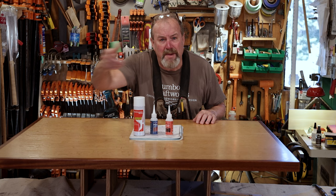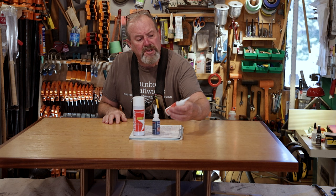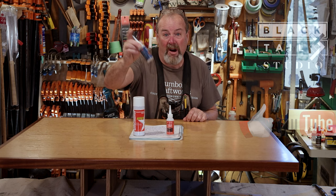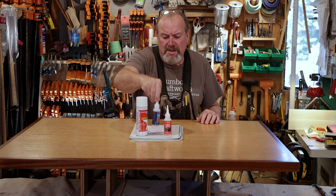We're going to see if the medium or the thick works better for filling in dents and dings on a veneer top, which this is. Sometimes when you put the accelerator on it last, like you're supposed to, it bubbles up and does weird things. So I'm going to try in this video to shoot some of this in there first in the bigger holes and see if it kind of balances it out. So today we're using Starbond cyanoacrylate glue with the accelerator. Now the reason we're using Starbond today, who is not a sponsor, is because I saw a YouTube video with a guy named Cam from Blacktail Studios making a beautiful walnut slab top. He used a ton of it, and I figured I wonder if that'll work for these tops.